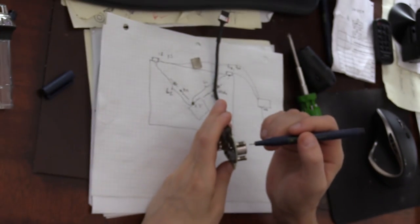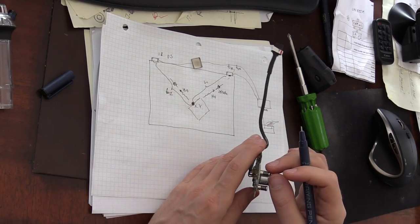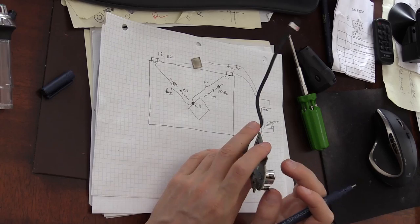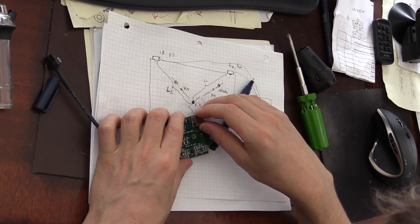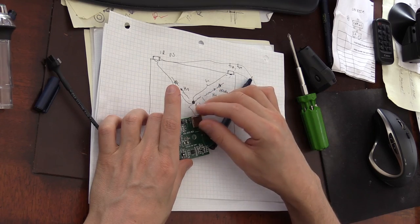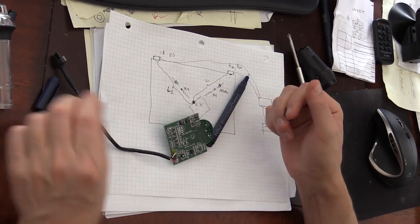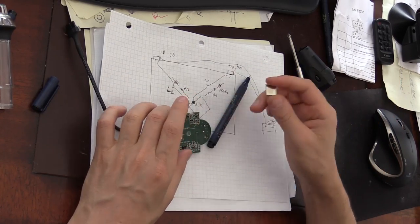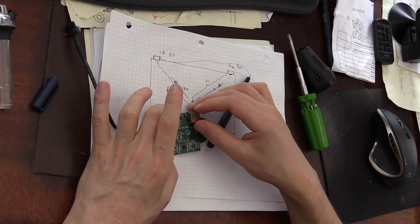These infrared sensors are shielded, placed inside two metal cans that provide the shielding, and that's necessary to make them more or less immune to all kinds of EMI. In addition to that, they also had this shielding on the first stage of preamplifier. It was soldered like this. I had to desolder it. I was looking at what's inside, and basically it's a very, very primitive circuit: two transistors, two capacitors, four resistors. That's all that's in this preamplifier.